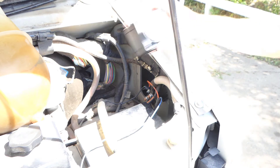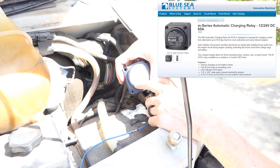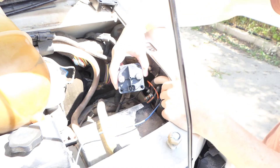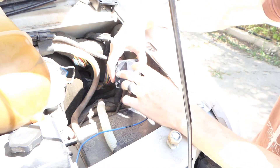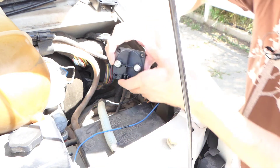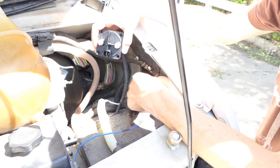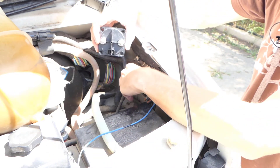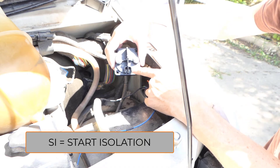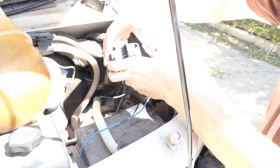One of the great ones I recommend is this Blue Sea Systems latching solenoid — it's meant for continuous duty. This particular one is the 7601. On the back it has pretty much the same terminals: two big terminals, and on this one it doesn't matter which one goes to the starting battery and which is the house battery. Down here on the bottom we have a ground — that's one difference, since the old solenoid was case grounded, so we're going to have to add a ground. These trigger wires are based off the ignition switch only in the run position, but we actually want this to go to the start, so we need the cranking signal to go to this terminal. I'm going to look for an ignition circuit that's off the crank position.